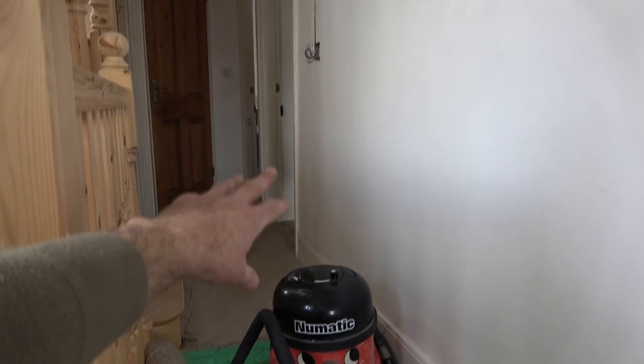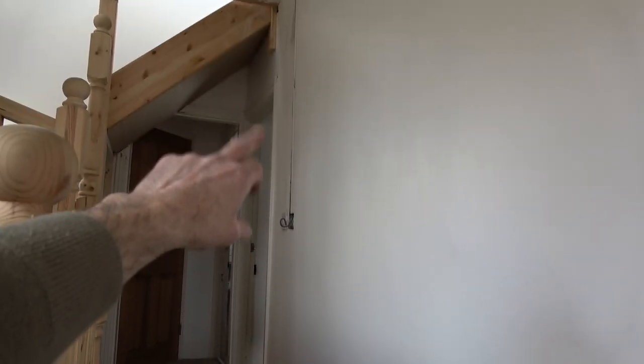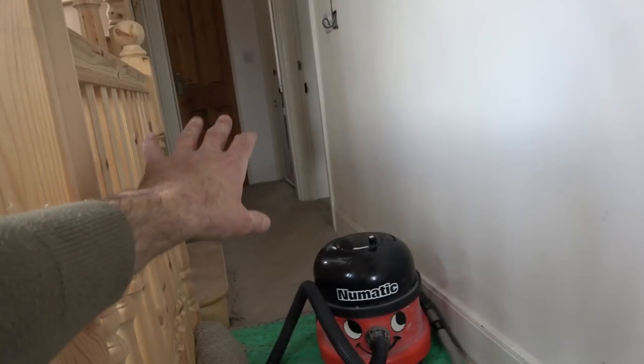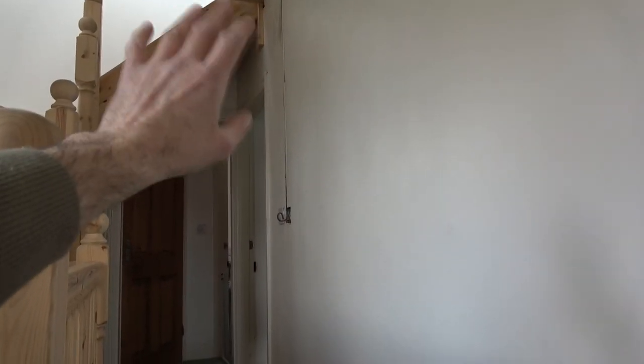What they've actually done is built the four walls around the house. They then built one wall in the middle which is solid all the way up, with solid lintels, and this is why we chose this one as part of the loft conversion to support the joists on. Then these joists run from one side of the house to the other side using this solid wall in the middle to support them. They then brick around those right the way to the top, and as I said, I've now used that to support my joists in the loft.